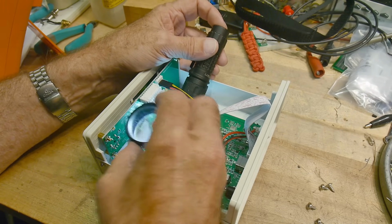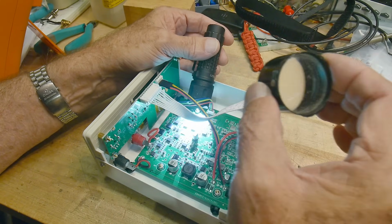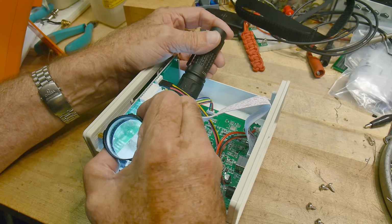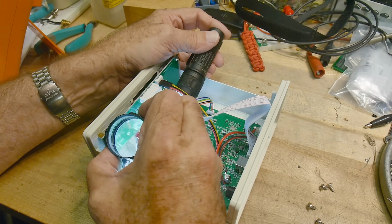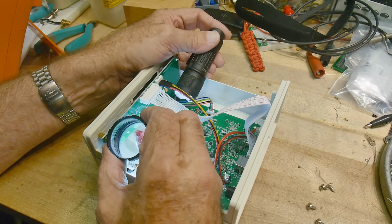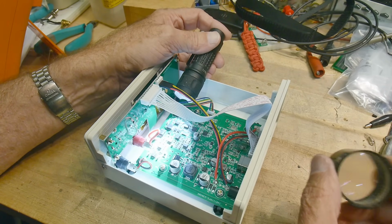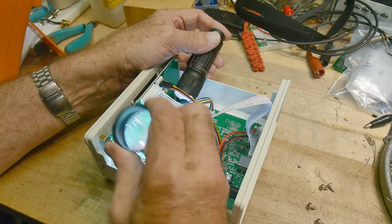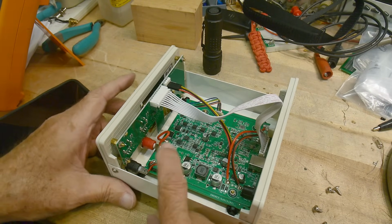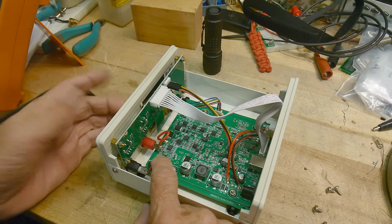And we've got an LM358 there. Why don't you use a quad? Oh, well. We've got an LM358 up front. And we've got an LMC7660. Isn't that a DC to DC converter? That's right up here where you would measure the current. Maybe that's a fancy... No, I remember doing a video on that. That is a switched capacitor voltage inverter.